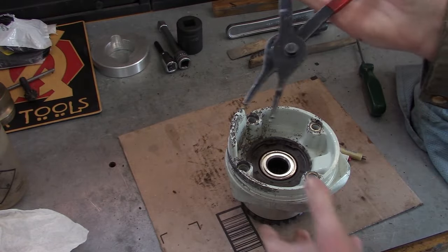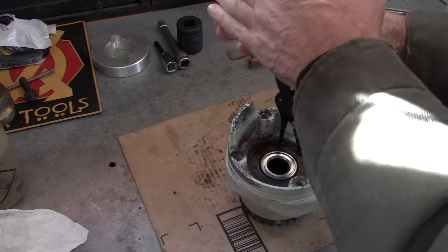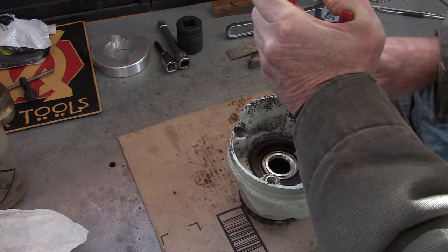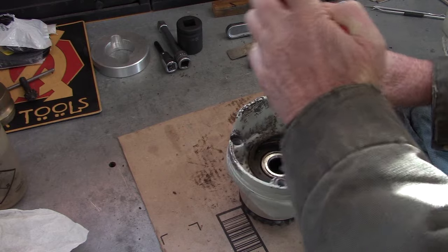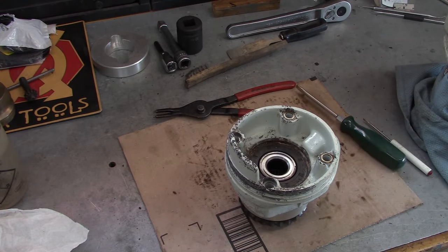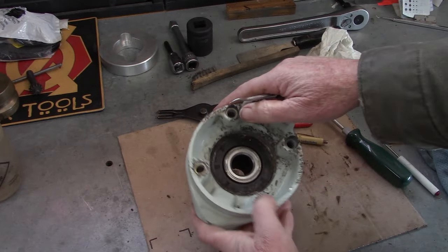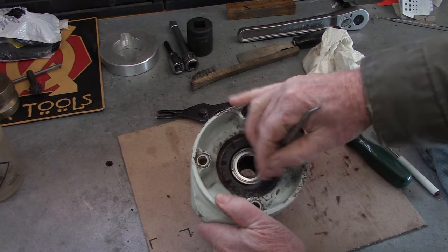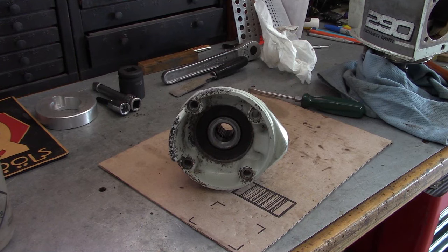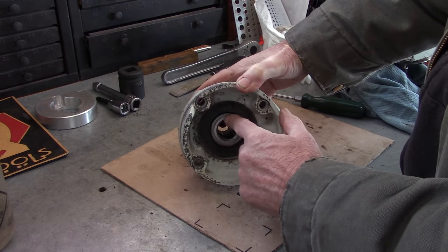You're going to need a really good, heavy-duty pair of snap ring pliers and a couple of small screwdrivers to help you coax the snap ring out of the groove. Make sure you've got safety glasses on — this snap ring is no joke if it takes off on you. That's exactly why you want safety glasses. Then take a minute to clean around the seal and clean the snap ring groove — it'll make life a lot easier, and you don't want debris going into the bearing.